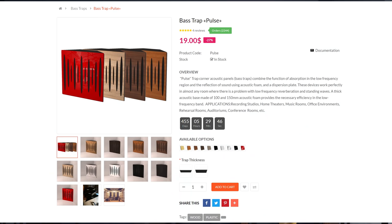These are bass traps — three bass traps. They look a little bit different from traditional ones. They have two corners and you put glue on each side and mount them. All of these are super glued using a foam glue, and it's very important to use the specific right foam glue. I'll link the ones I used in the description below. If you use something like Gorilla Glue it will fall off — I'm warning you, use the right type of glue.